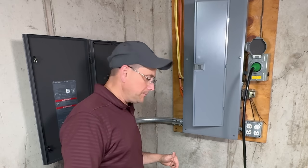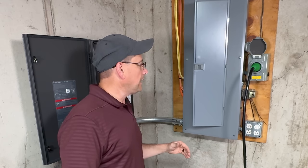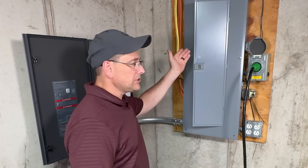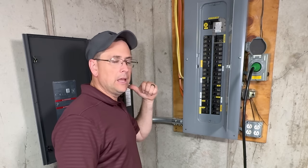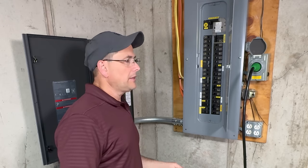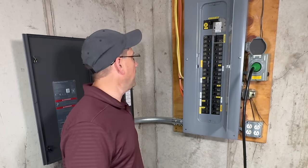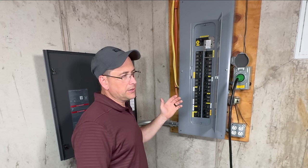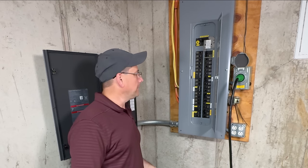The Ultra can be hooked up to a 50-amp hub. So if you have two of these and don't want to spend the money on the panel, you can get the 50-amp hub which allows you to get almost 14,000 to 15,000 watts and still do the same thing without the Smart Home Panel 2. The Smart Home Panel 2 is pretty much the Cadillac of the whole design — you can hook up three different inverters and it's got all the features. It's somewhere around $1,700 to $1,800, usually cheaper with discount codes. Otherwise, you can get a dedicated manual transfer box that runs anywhere from $300 to $500 to $600.